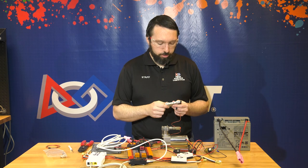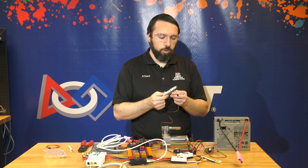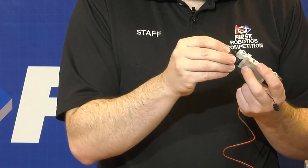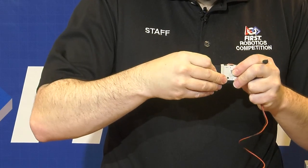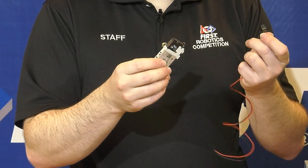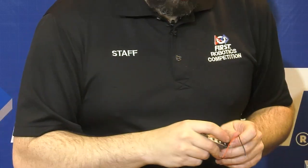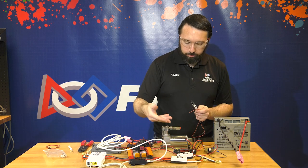The last piece of your pneumatics to wire is the pneumatic solenoid. This example is a Festo valve; other valves from other manufacturers likely work similarly. This valve comes with a separate electrical piece that snaps onto the end — there are little keyed connectors that tab in, and then the connector clicks in to secure the electrical connection to the valve. It also comes with a pigtail wire ready to plug in, and the red and black wires run back to any of the individual channels on the pneumatics hub using the same Weidmuller connections.